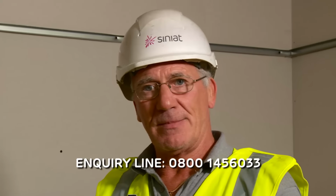If you're unsure, contact our inquiry line. Tell them what type of plasterboard you're using, how many layers of plasterboard you're applying, and they will guide you to the correct centres for your primary channels. The metal angle will always go at 1200 along the primary channel.